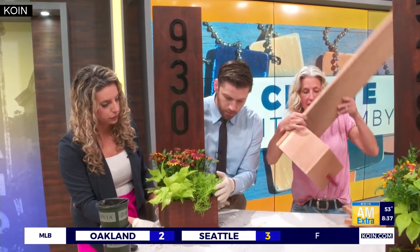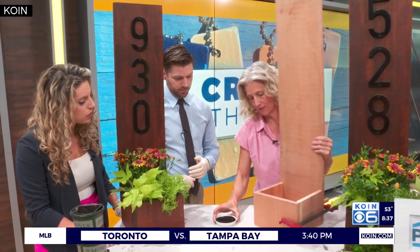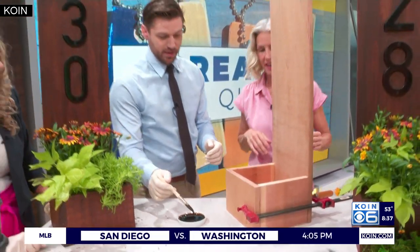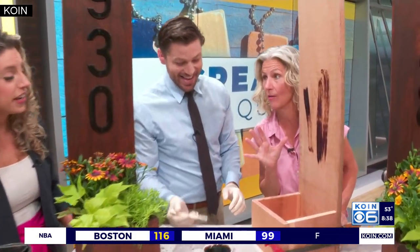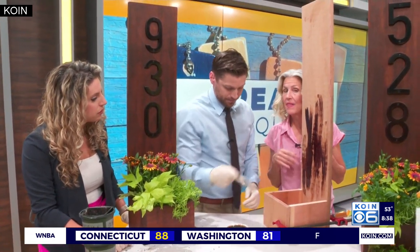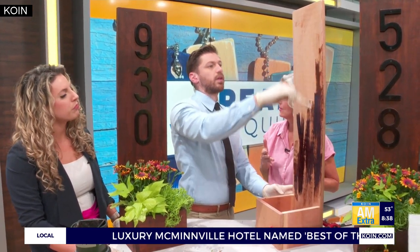You can kind of see this in the front. You can paint this, or I always like to stain it — I like to get the richness of the wood. Travis, you've got your gloves on — this is the same stain as you've already painted here. No lines for you to stay inside, no lines — you can just go. It only takes about one coat of stain. Before it dries, let it sit for about 10 to 20 minutes before it gets tacky, and then wipe off any of the excess.